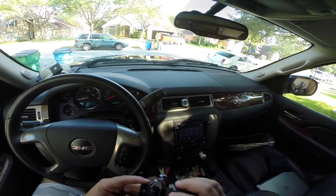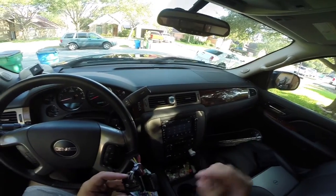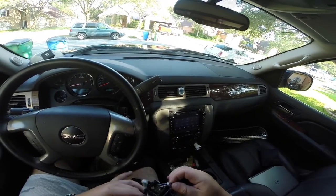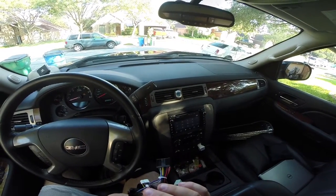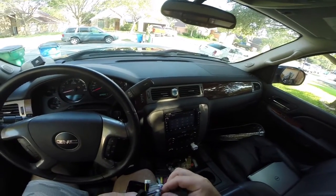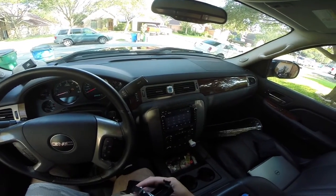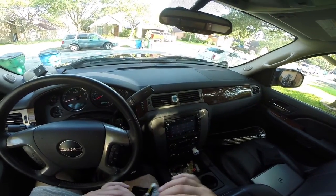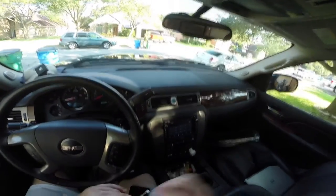It looks like it's basically a capacitor filter, because all these lines are what run through for the sound. These are all sound lines for the audio. These are the different channels: white, gray, green, and purple, as well as blue, which is just feeding 12 volts to this. So some sort of filtration thing. Basically right now I'm gonna swap this out and see if this hissing goes away.